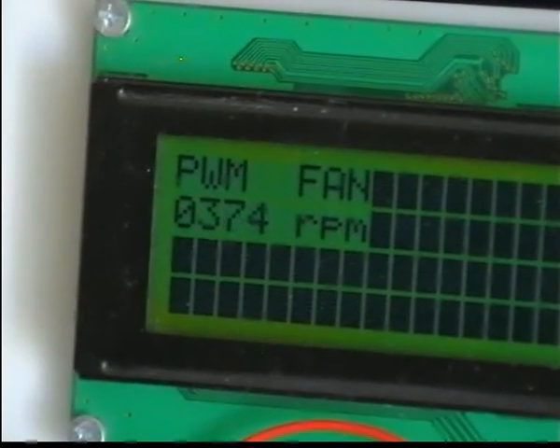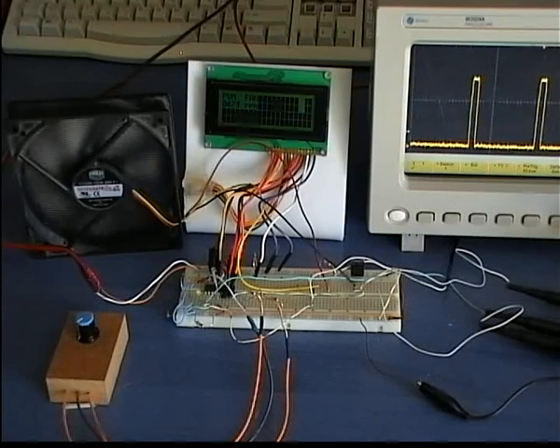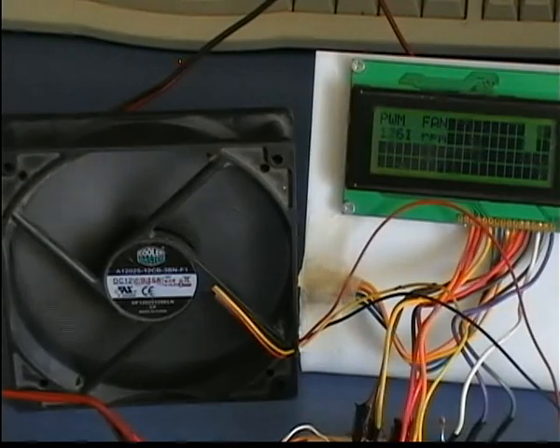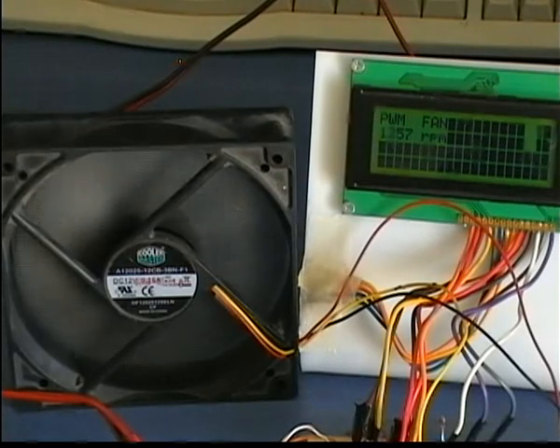That's a remarkable feature of this method. With the potentiometer, I can set whichever speed I want. When it's turned fully to the right, the fan rotates at full speed. The circuit will get RPM feedback twice a second, which is quite a fast feedback cycle. You can change this feedback easily by altering one line of code in the assembly listing. With a slower feedback cycle, you can achieve even slower fan speeds.